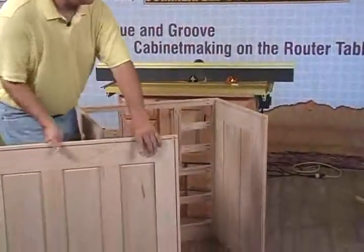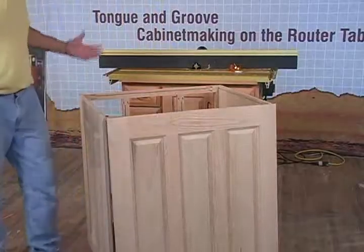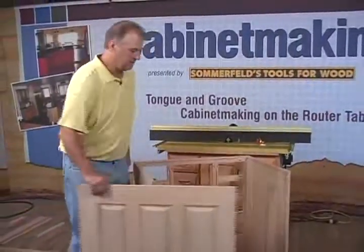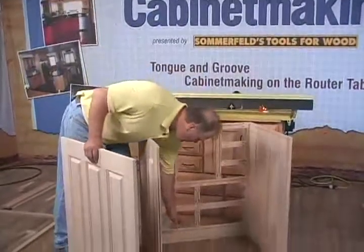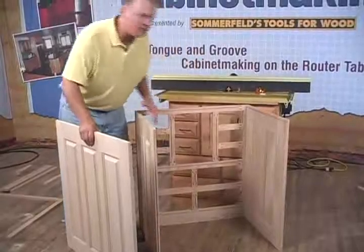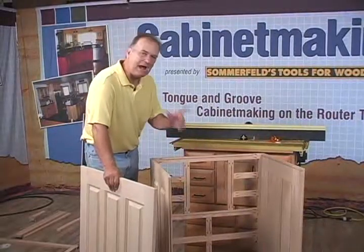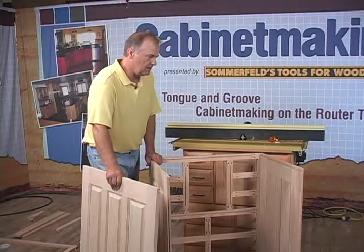We cut the groove here, and that right there is going to cut on those tongues, and that's going to form the four sides to our cabinet. Now, we do not want to put this back on yet, because before we put that back on, we want to come into here and put the floor on the bottom piece, and the partitions coming in here next. And to get that, the dimensions in your sheet should show you how to cut them, but I would measure just to make sure. And we'll show you how to do that measuring first.